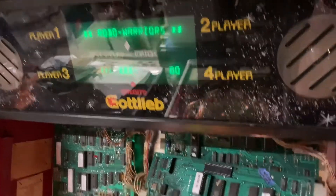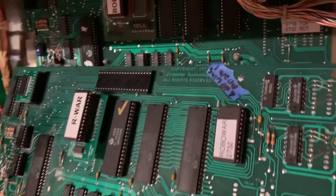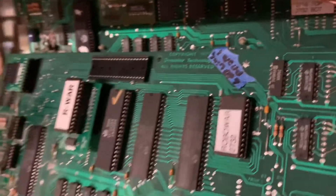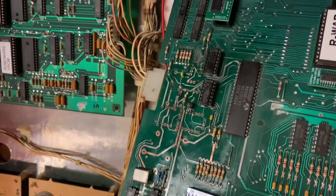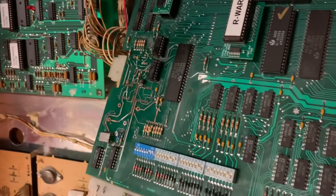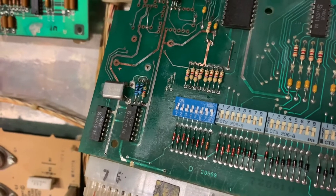This is an MPU - Goldwings, yeah - and I've got my RoboWare ROMs in it right now. The client had taken some steps to abate some alkaline corrosion and did a pretty good job. I cleaned up a couple of things, put a different reset generator in, and brought it out to test. I had to take out this DIP underneath these things - you always have to take these out because if there's corrosion in this area, there's probably corrosion here too.